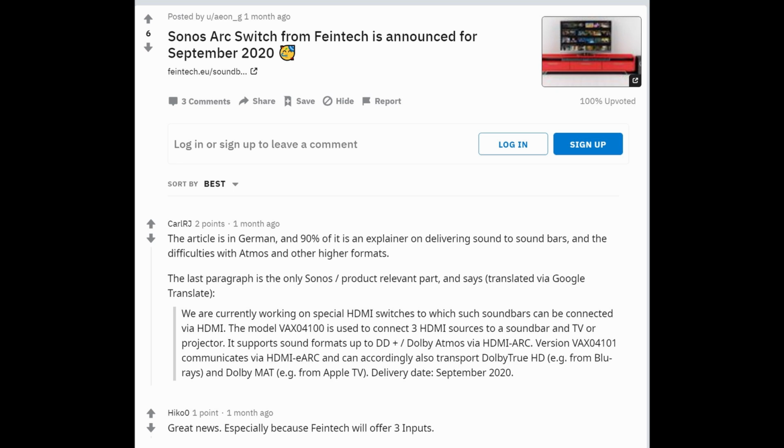The only question I'm not sure about with that one is I have to have two signals go to two places. See, I have to have the HDMI signal, either 1080 or 4K, go into my projector, and I have to have the other signal carry the ARC out. So that's very important. Having one ARC or one eARC output from the switch isn't going to do me much good because I have to split that into two, which brought me to the next company, which might be the answer.